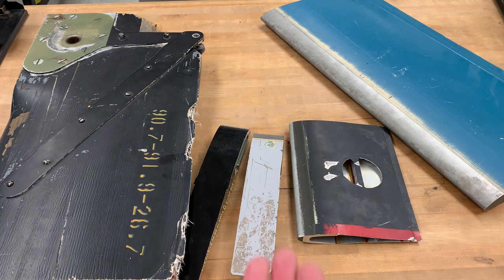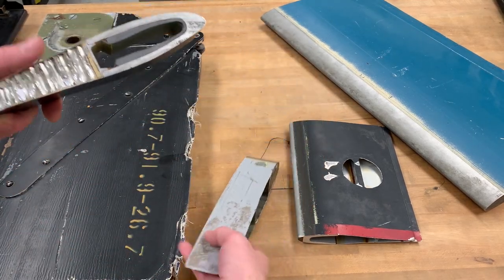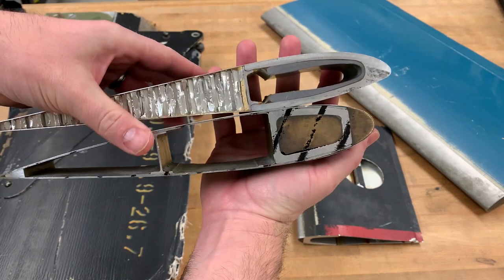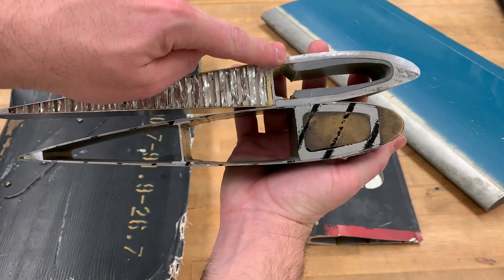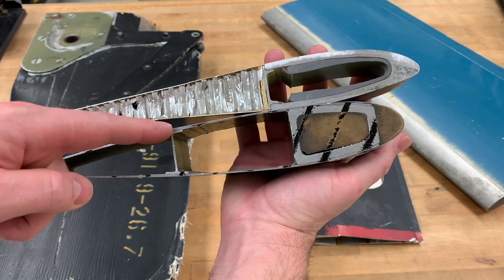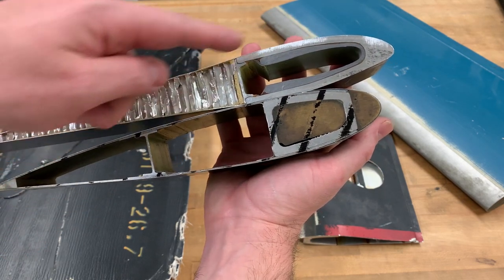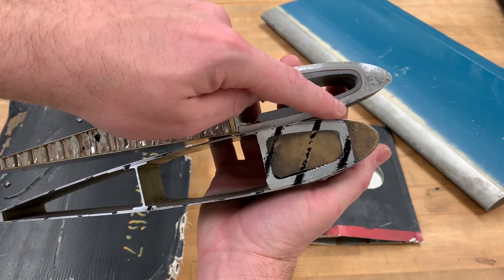So all three types are creating lift, but it's the airfoil shape that's going to dictate the actual efficiency of the blade. This one here is a symmetrical airfoil; this one is asymmetrical. If I drew a line right down the center, a symmetrical blade is going to be the same on both sides. If I drew a line down the center of an asymmetrical one, you can see the contour is different on the upper edge than on the lower edge.